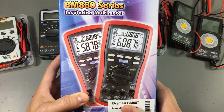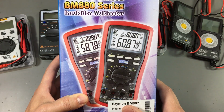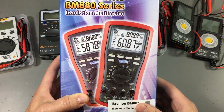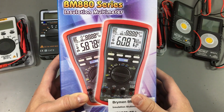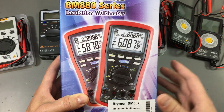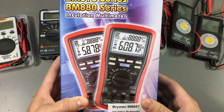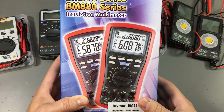And that should be similar to any kind of situation that you might encounter in practice, like for example if you are measuring some kind of circuit and that circuit fails, or if something behind that circuit fails and it sends a voltage transient. You might be in the ohms range, you might be in the volts range, it doesn't matter. The multimeter should be capable of absorbing that transient voltage without failing and without generating any dangerous situation for the user.